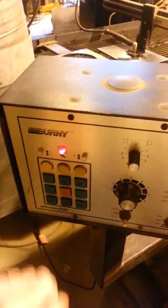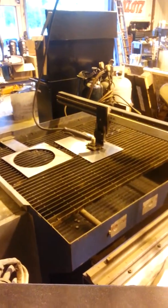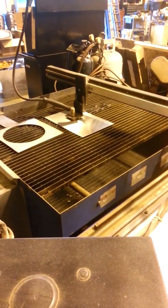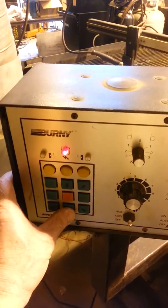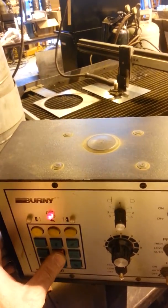We're going to turn on the console — it's already turned on. You can see the light on there. We're going to jog that part back and forth so you can see it. You can set the speed on it, stop it at any time, bring it forward, bring it backwards — whatever you want to do. The reason for jogging is so you can get to that particular piece of metal that you want to cut.